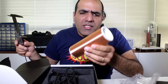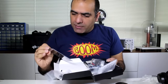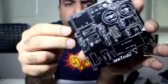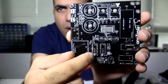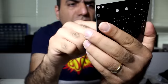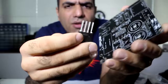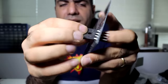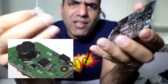I count around 92 turns per centimeter, and the whole thing is around 16.7 centimeters, so roughly around 1,500 turns. So many components — let's try to learn as much electronics as possible from this. This is what's called the printed circuit board, or PCB, that contains all the copper wirings required to connect the components together. The white stuff printed in white ink is called silkscreen and shows the location of the components on the board, including an outline and reference designators like IC1, IC2, CA — which show which component goes where.